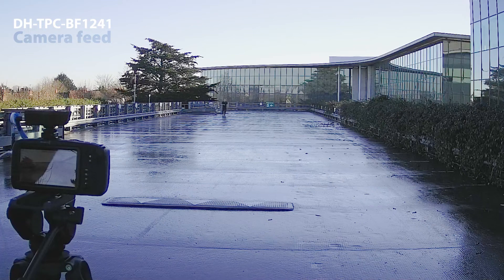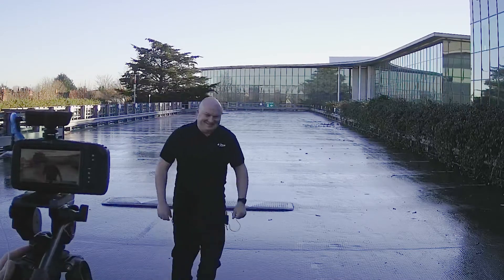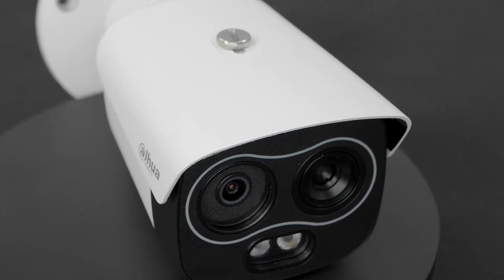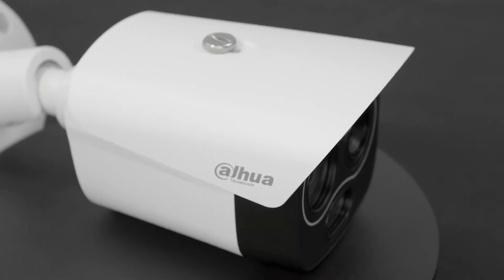With thermal imaging, it's a lot easier to see a heat signature go over the line compared to the study of multi-megapixel change. Our products range from detecting someone going over the line maybe one metre away, all the way up to four kilometres away. Granted, on those cameras the lens will be the same size as a football, but it can be done. With this camera, I can get possibly double the distance on the intrusion detection area of a hot subject going over the line than with a regular IPC camera.